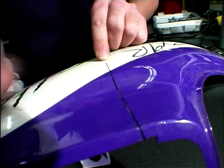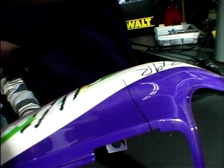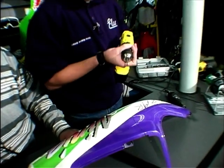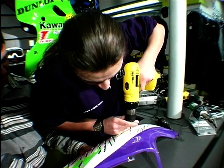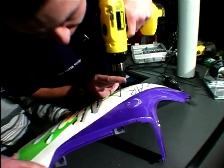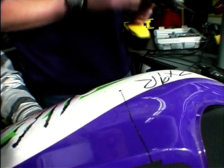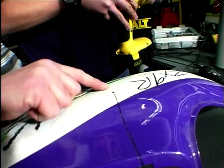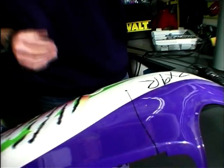First, what we've got to do is drill a hole here to stop the crack. I'll hand you this drill. And I've got a use for that drill — it might just take me three years to use it, but I've got a use for it. You're welcome to it. So what's the reason for drilling this hole — just to stop the crack wandering? Yeah, just to stop the crack going any further.